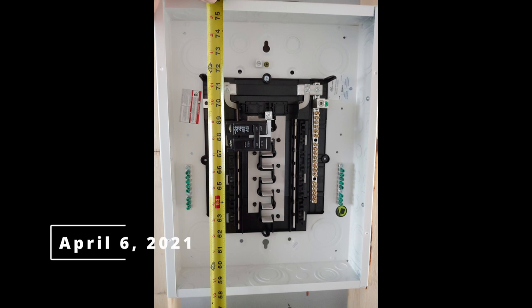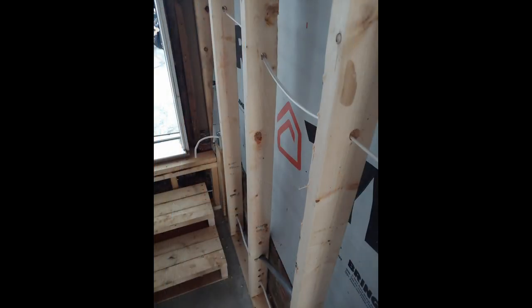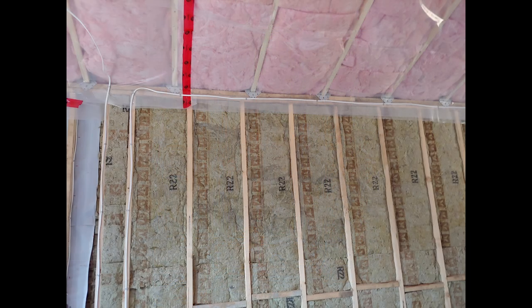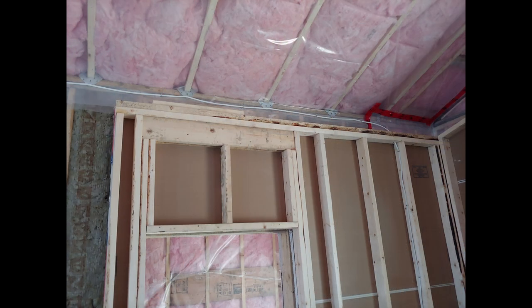Although we'd pulled the electrical run for the panel, the panel had not yet been connected. So I was running cabling back to the panel and just leaving enough length to connect it when it was going to be done. I ended up with five different runs: one for all the lights in all three rooms; one for the kitchenette area on a 20-amp circuit; one for the front of the control room so my audio interface and mixing gear could be on a dedicated circuit; one for the tracking room; and one for the control room and the entry.